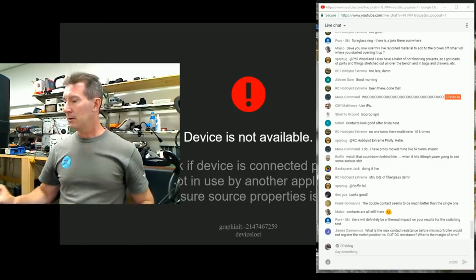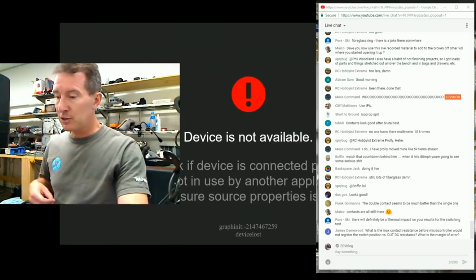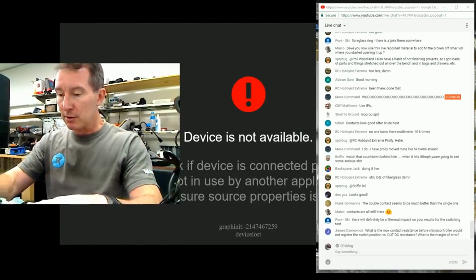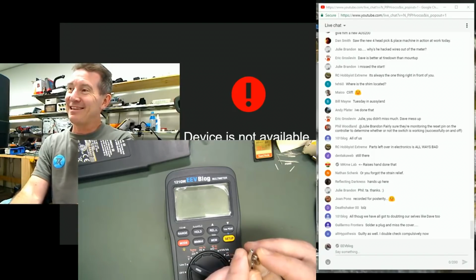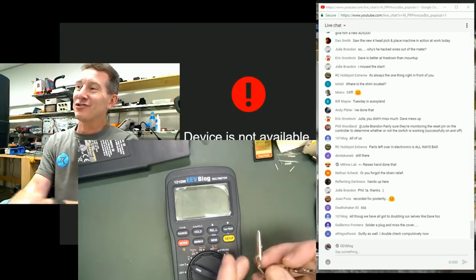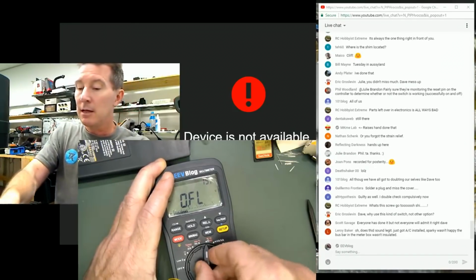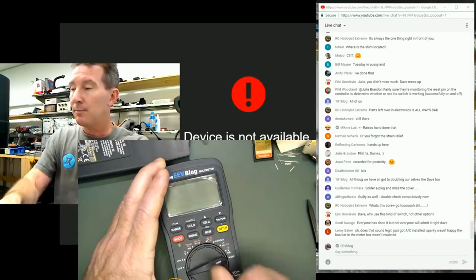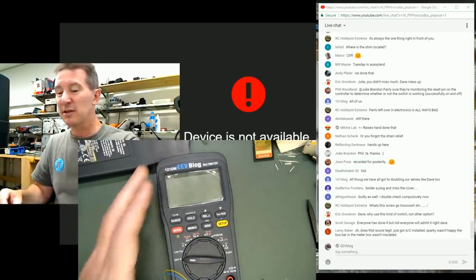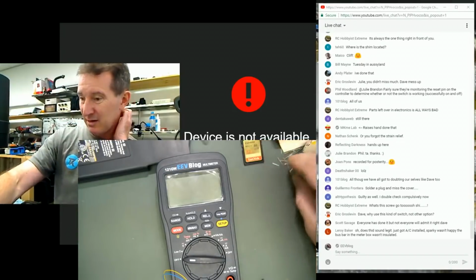We were at about 2.7 ohms on the switch. So we can put that back together and measure it. So if I do that, we effectively have the reset line. We're actually shorting out the reset line of the microcontroller. Wiggle, wiggle, wiggle, wiggle, wiggle, yeah. Nah, see? It's all hunky-dory. So yeah, it's all good. So that's done 9,000 cycles now. So apart from the fiberglass dust in there...